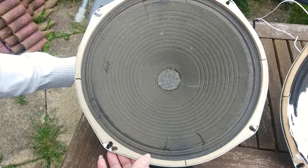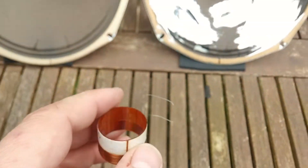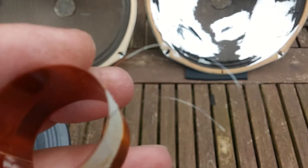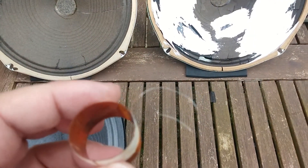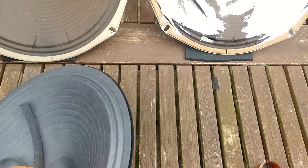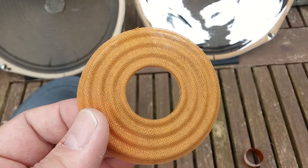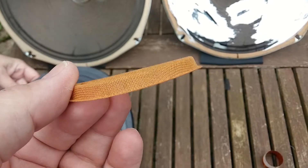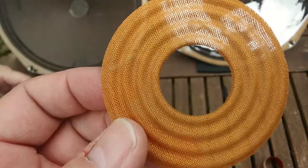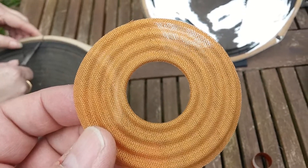So that's soft rubbish. Now let's have a look at the components of a speaker. Voice coil — this sits in the magnet. These two cables here are what we solder on, the main speaker leads. This is the spider — this supports the cone against the inside of the magnet and the speaker basket. This is very important: you need to get the correct size spider, the correct cup, and the correct properties to make sure you get the right spider.